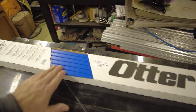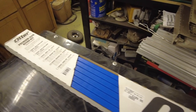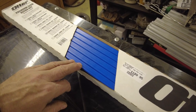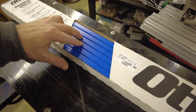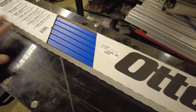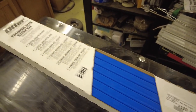One advantage is that anytime these skis are going to be drug over some bare pavement, the Hi-Fax, which will be replaceable, will take the brunt of the load. And as you see, we got six of them here. Only need two, and my cameraman needs two, so that'll leave two spares that I can put on at another time. The big advantage to putting the Hi-Fax one strip down the middle, we're hoping it's going to provide some substantial improvement in directional stability.